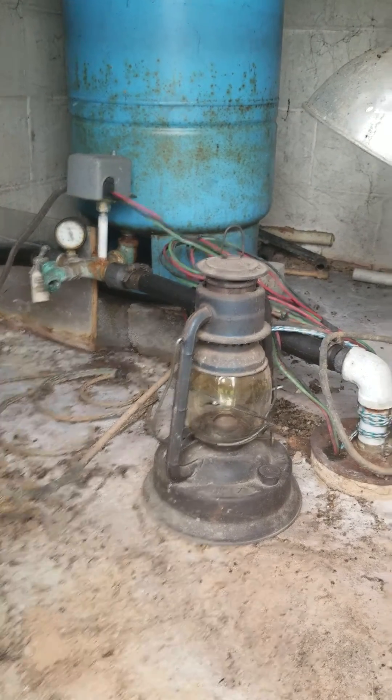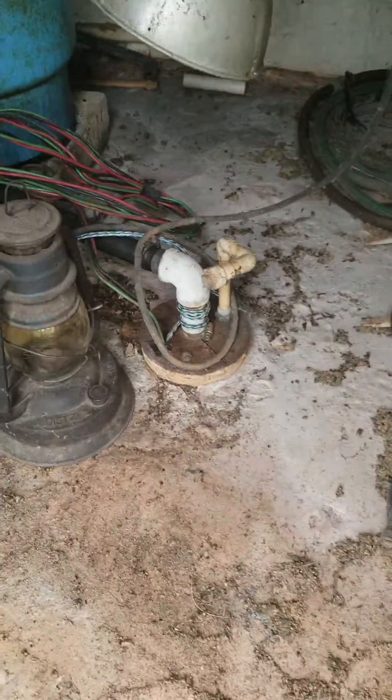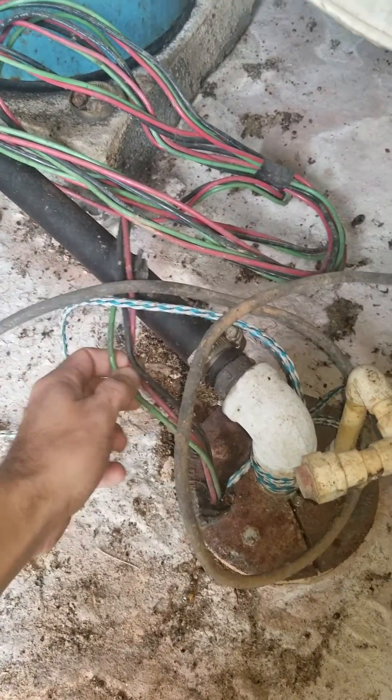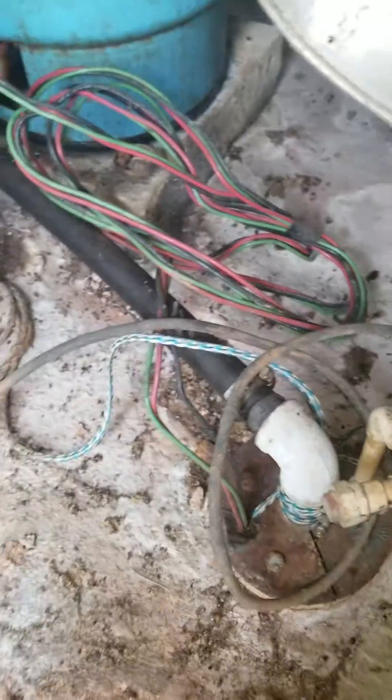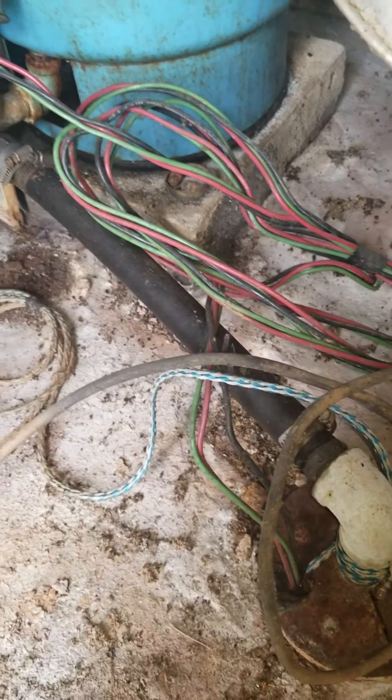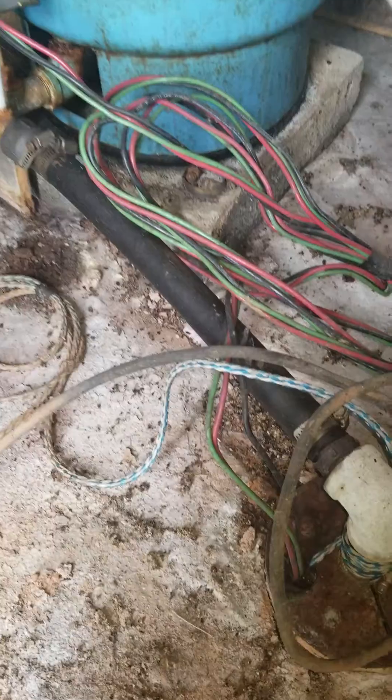Either your pump can be dead and locked up, and that will trip your breaker. A way to tell that is with an amp meter — you clamp around just one of your wires here and it should go upwards of 20 to 30 amps, then flip the breaker if it is a 240-volt system.